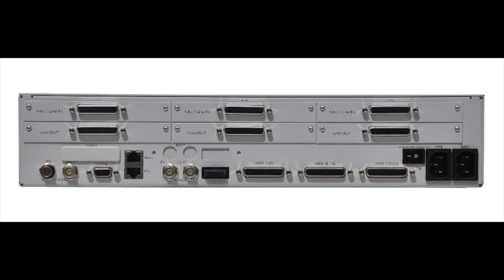Horus has MADI, a standard 24 AES/EBU, networked audio, and then six slots to populate with AD/DA cards. You can put a second MADI card in without taking up one of the slots, and you can put up to two Pro Tools cards in. Each Pro Tools card gives you 64 I/O at standard sample rates, though it halves at 88-96kHz. You can load the Horus up in a 2U box with 48 AD mic preamps and 48 DAs — 48 channels with mic preamps.